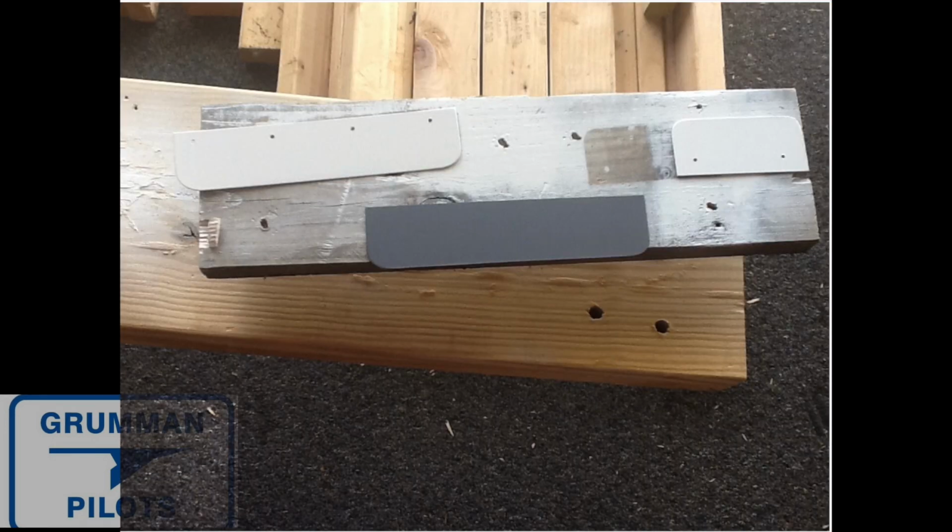Now, the other thing we noticed as we were surveying the aircraft was there were no adjustable trim tabs on the ailerons or on the rudder. And when we asked the owner about that, he goes, "Oh, it was part of the STC for the bigger engine. You don't need those anymore." The truth of the matter is, they had been on the airplane. They had just vibrated off the aircraft, and also the airplane vibrated enough to crack the belly.